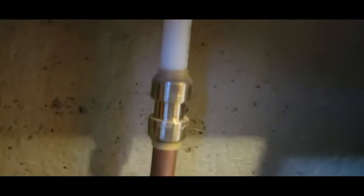Back to that shower head — it was so low I wanted to move it up, and to do so, out here in the hallway I had to cut a hole. The shower handle is way down low here. I did a stud finder but couldn't find the studs properly because there's a bunch of cross bridging. But to move the shower head up — this is copper plumbing — it used to go out right there, and I put in one of those chrome covers and extended the same pipe up. I put on a PEX extension, so we moved it up.